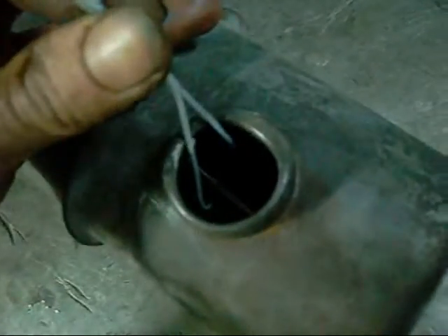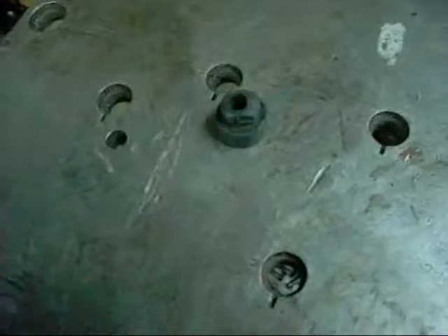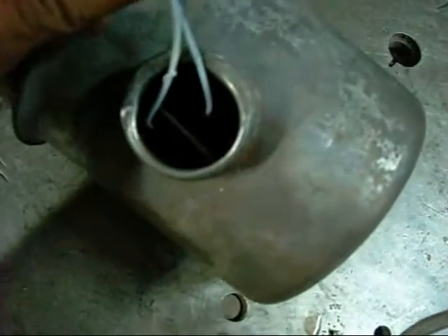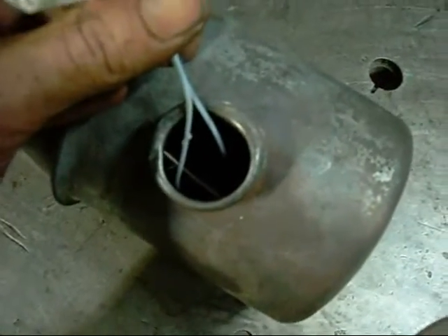It's basically a good example of what I was talking about before. Once you loop the cable over the sacrificial anode, you can sort of pinch it in place with a rubber bush and keep it there. That silver rod in there is the sacrificial anode. So as long as it isn't actually touching the inside of the tank and is sitting right in the middle, it will work very well.